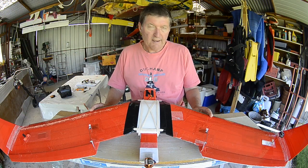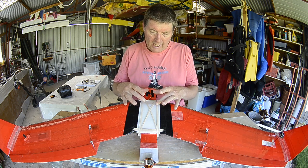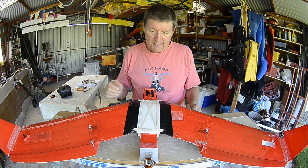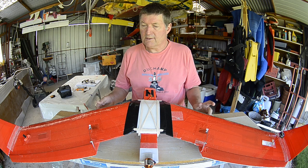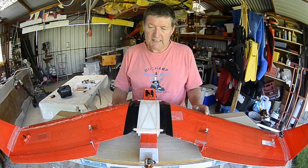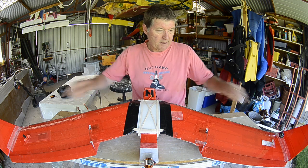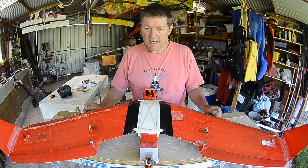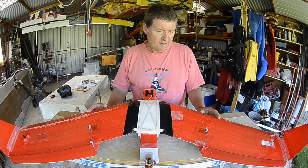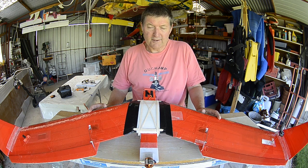That's my basic FPV setup. I have tried little backpacks where the transmitter and camera are mounted on one box at the CG spot — they work really well for slope or close-proximity FPV and get you about 400 to 500 meters. With this setup, with everything optimized and spread out as far as possible, I could probably get maybe 700 meters, though it's hard to tell without a GPS module.